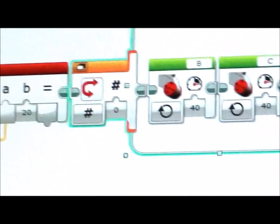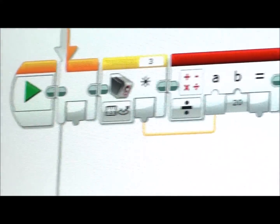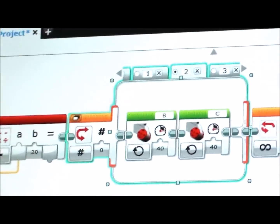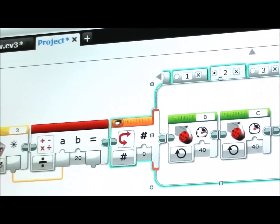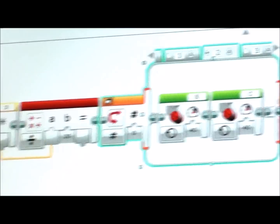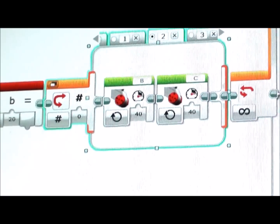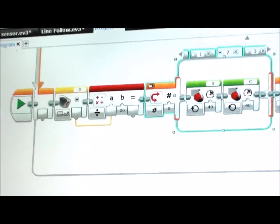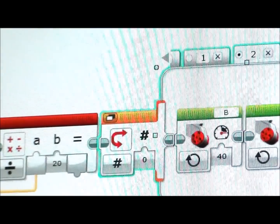To give a quick overview: we selected a loop, took the light level, and divided it by 20 because the maximum value is 100 — dividing by 20 gives us five cases. The five cases handle when the robot is far left, slightly left, right on the line, slightly right, and far right. The power numbers are in the description. Thank you for watching, I hope you enjoyed and I really hope this helped.